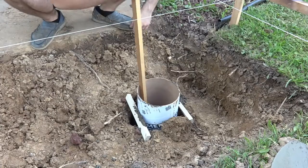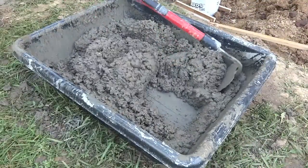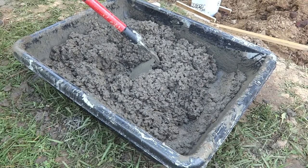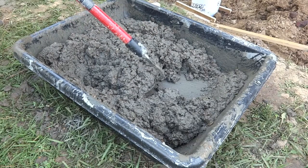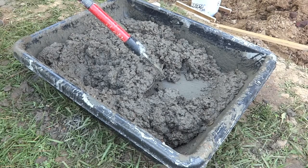Just making sure it's all packed down really good — I don't want any air pockets. For the second batch I put just a little more water than recommended, about 4 quarts which is a gallon instead of the max 3.5. This is more like I imagined — definitely right on the edge of being too watery but I think it'll be fine. I noticed when I put the concrete in the tube it moved on me a little bit. It's still level but shifted down about half an inch, so my little boards and screws in the cardboard tubes wasn't the best idea. I'll have to bring it up about a half inch higher than the tube and level it off.